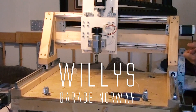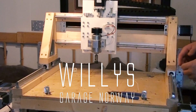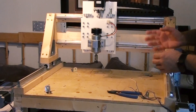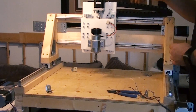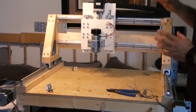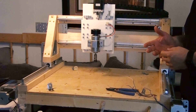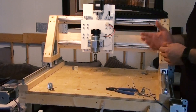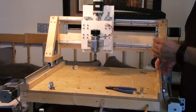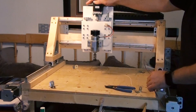Hi good people, here you have the machine today. I have stripped it of all the preliminary wiring and my mission now is to wire all the engines and lay every cable I need for the machine to work properly. As I have shown in my previous videos, I have wired up the TB6560s and they work. So I look forward to wire up my NEMA 23s to the TB6560s.